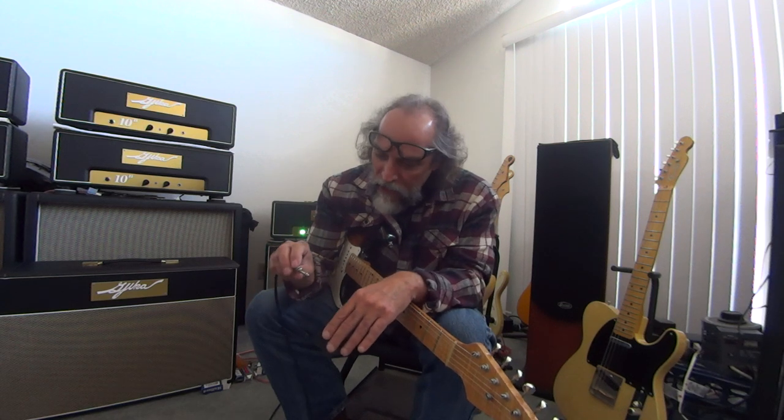What do you think happens to that contact point, that tiny little knife of a contact point, when that thing's been sitting there all week, let alone a month or 2 months? It won't make as good of contact. Your board sounds okay some nights, some nights it doesn't. So almost every time or every other time I turn on, because I don't have 100 effects on my board, I take each cord and just twist it back and forth in there. Just clean the cord. It's so simple. Make sure it's seated in there good, but just turn it back and forth and clean it.